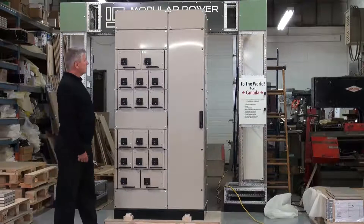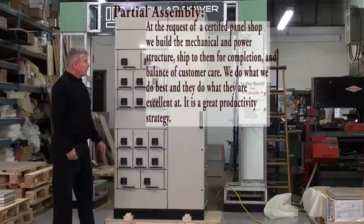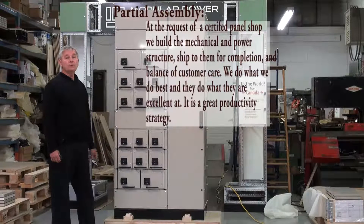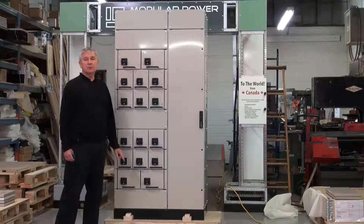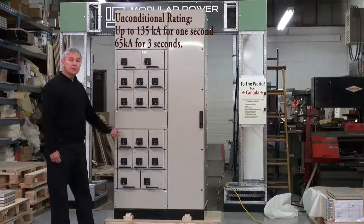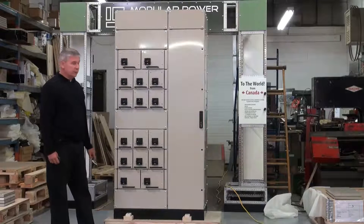In this particular case, we have a partial assembly — a mechanically built assembly including bus bar, rated at 690 volts maximum and up to 8500 amps. The key important feature in this design is the unconditional rating of the bus bar system, which ensures that in the future, if there are any changes to the equipment, components, and design, the user remains insured and liable for the equipment on their facility.